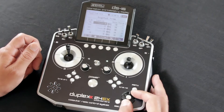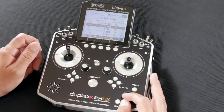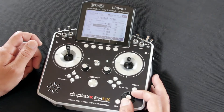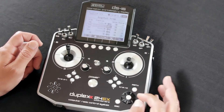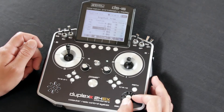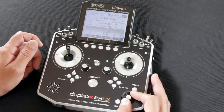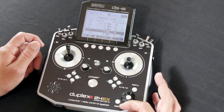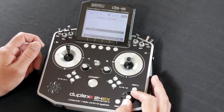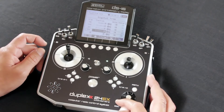So instead of Ailerons, we're going to make it Rudder. And instead of Elevator, we're going to go ahead and make that Throttle. That's going to allow us to trim the left-hand gimbal with the right-hand trim buttons. We'll go ahead and go down to the left-hand trim buttons and reassign those as well. Once we've gone through and done this, I'll show you how it functions. We'll change Throttle back over to Elevator, and now you're covered under all of the trim buttons.